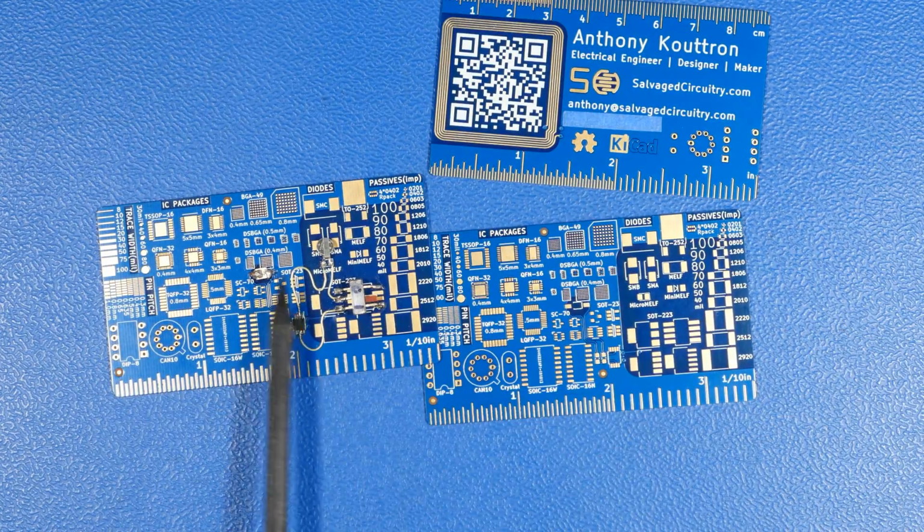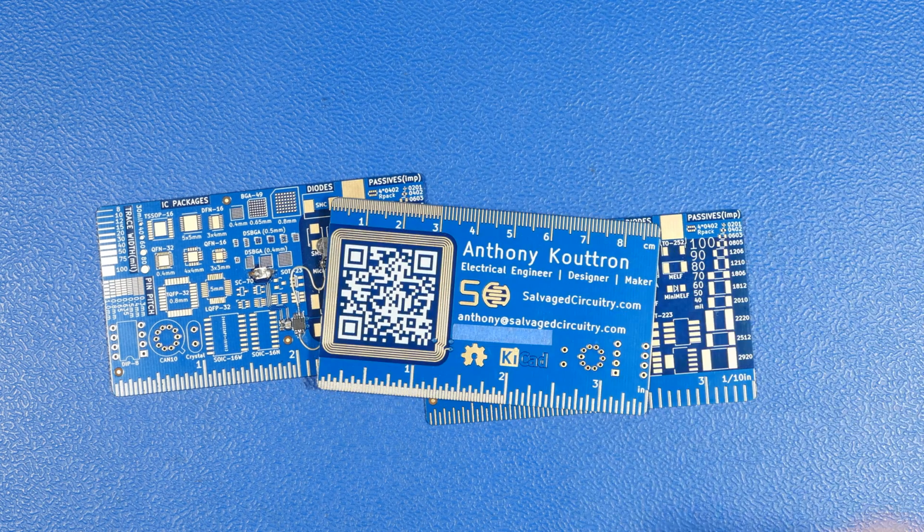A redesign of the coil closer to 2.75 microhenries or 2.35 microhenries, as well as a reshuffling of components on the backside of the coil, should improve coil performance and allow for greater harvesting capabilities of the NFC chip. I may remove a layer of solder mask underneath the LED to improve performance as well.